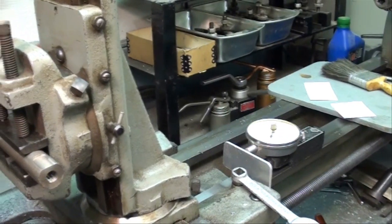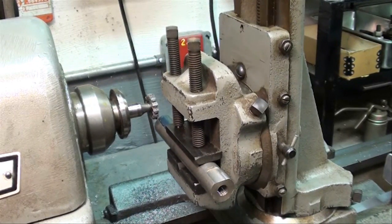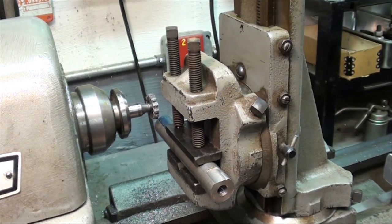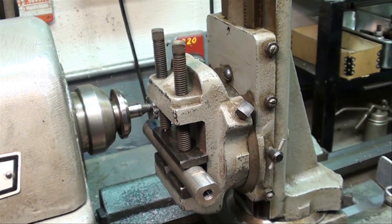So I'm going to lower the work so I don't damage the cutter, and I'm going to move it in 468 thousandths — I'm looking at my indicator even though it's not on screen. Now we're 468 thousandths in.